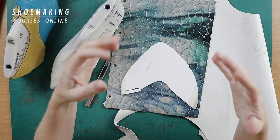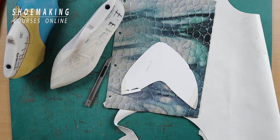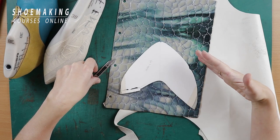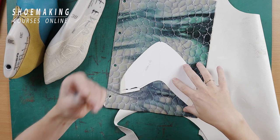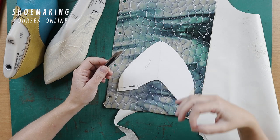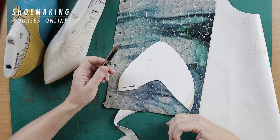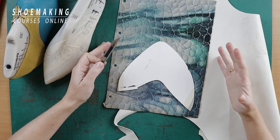It's important to understand that you should know how to do every step correctly. For example, I see many people who cut their uppers and lining with scissors and it's wrong. In shoemaking we call this process 'clicking' — when we cut upper and lining. We should do it with a knife because with a knife you will cut precisely, whereas with scissors you can miss a few millimeters in some places, and in the end it will influence the correctness and look of your upper, resulting in uncomfortable or bad-looking shoes.